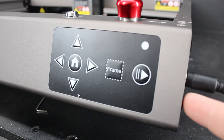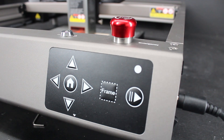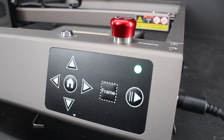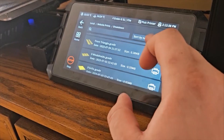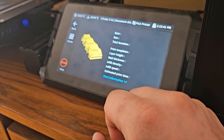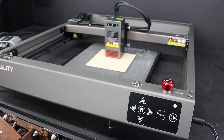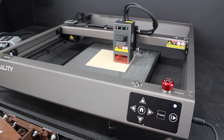You've got these buttons, but that's kinda it. Unlike its Ender siblings, the Falcon is your basic CNC laser cutter. However, that's not to say there's no user input on the machine. Most machines of this type you actually have to have constantly connected to your computer to run through unbundled software. Whereas in this case, the Falcon does come with an SD card reader. It can only print whatever job was uploaded to it last, unlike the selectability of a 3D printer. So that's less than stellar, but on the plus side, allowing an SD card to be read at all has given them the opportunity to design in a frame button. This button will read your G-code from the card and then trace out the perimeter for your file so that you know exactly where to place your material for cutting.